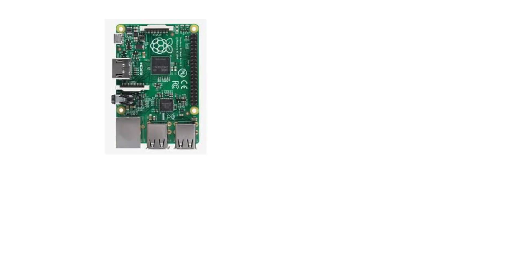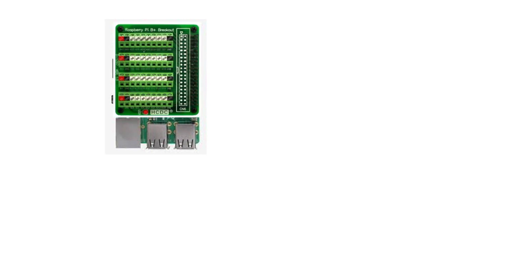The first piece of hardware is the trusty Raspberry Pi — a Raspberry Pi B+, which is what I have laying around and it seems to be working just fine. These things are little tanks. I did end up buying a breakout board and we're going to attach that right to the top. That breakout board makes it easier — it gives us screw terminals to tie into the GPIO header on the Raspberry Pi, so we can control LEDs and look for input on switches so we know if somebody's trying to shut the trailer down, giving the Pi time to shut things down properly.